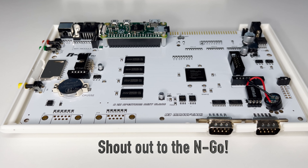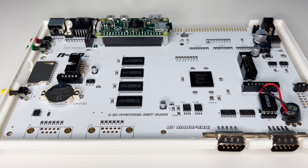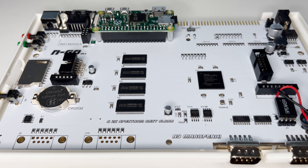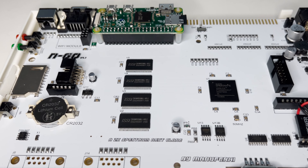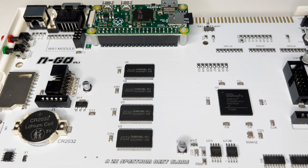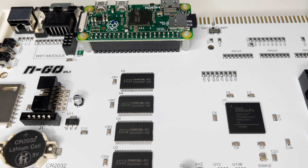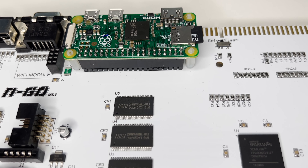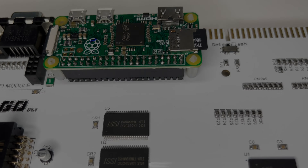While on the subject of HDMI, the ENGO board is worth mentioning. The ENGO board is based on the Issue 2B Next board and was created by Manuel Fernandez-Hegueras. It has fixes in place to correct the HDMI back power issue and also adds some ESD protection for the HDMI interface. The ENGO is currently the best route to Next ownership, even though they are suffering from part shortages and Spartan 6 prices have gone up significantly.